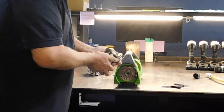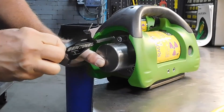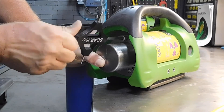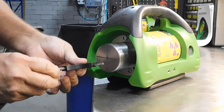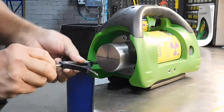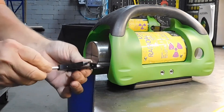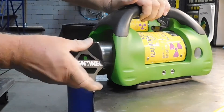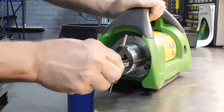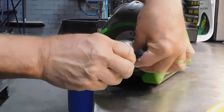This is the collimator right here for making contact shots. I'll simply insert it, and then once it's inserted, I use the quarter-inch Allen wrench and tighten the screws. There are no torque requirements here — you simply snug it up. There's also a screw for the index pin for the cable; just simply snug it up as well.